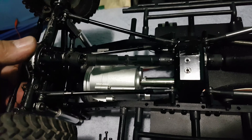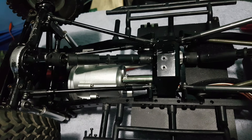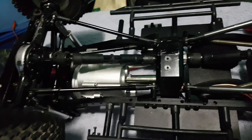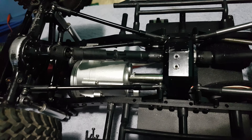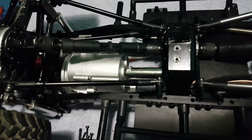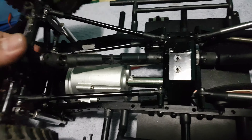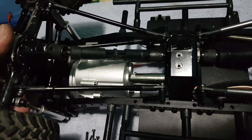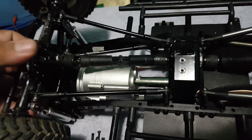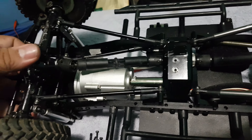The main reason why I did this is because when I first ran these shafts, the way I cut them they would bind and it was really annoying. I couldn't figure it out, and then one day I thought, what happens if I put springs on both sides to make them center — and that's what I did. I've been running these shafts for about a month and a half since I did this, and I have not had any problems at all. I have not replaced them once.